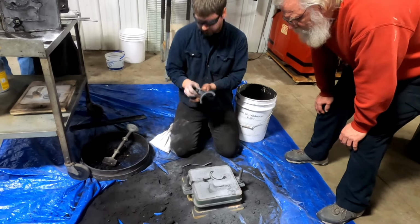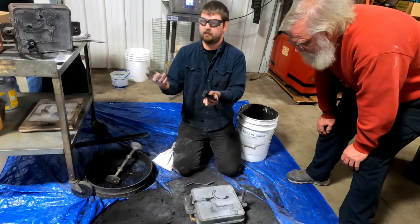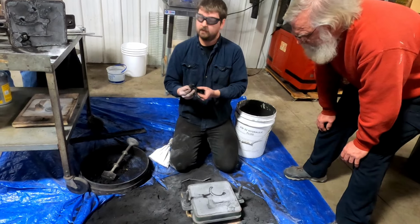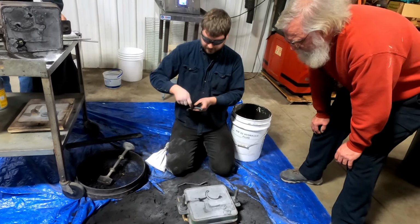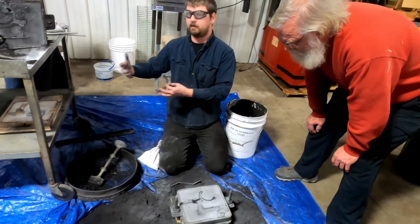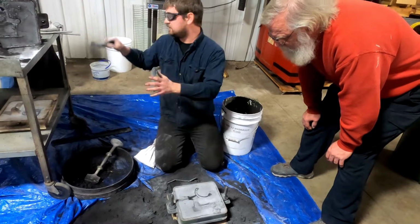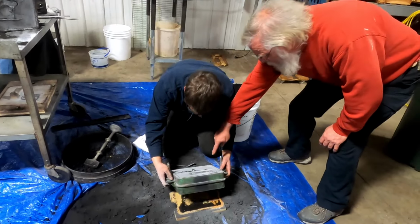I've got a little bit on the back right here. Well, that's really easy for me just to roll on my 2-inch belt sander, it'll come right off. Now, if I were to have some in this corner, maybe I have to go in there with an end mill, that one might be a question, right? If it's up in here, where it's really hard to get to, at that point I'm probably just gonna scrap the mold. So that's where knowing what the end use of the part matters. Some weird radius. Yeah. Somewhere where it's not easy to remove. That's the big key.